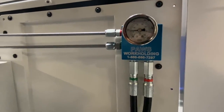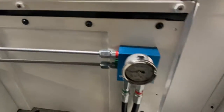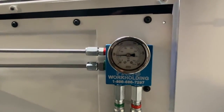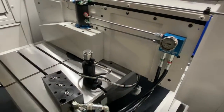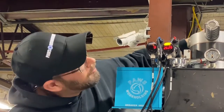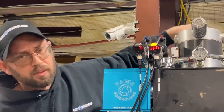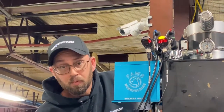I'll check the red line for leaks. I have no leaks up here, no leaks in the front. Everything looks good. Let's check the pressure gauge and see how much is on our pressure sensors on the pump, and then we'll turn it up. So you're setting the pump for 2,500 pounds roughly? A little over right now — 2,600, something like that.